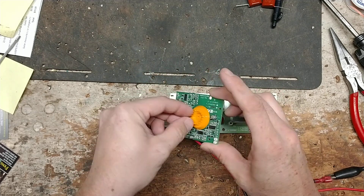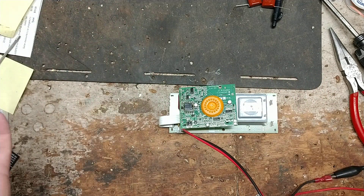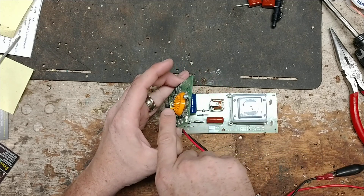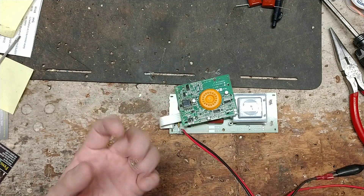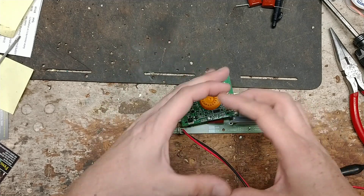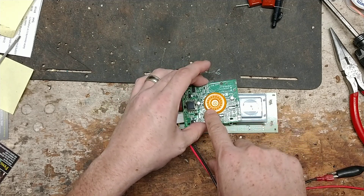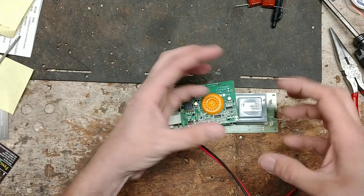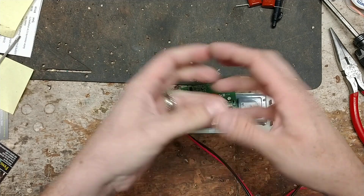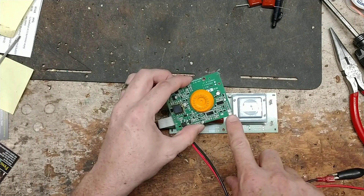This little piece here is part of the switch — this is where you turn it on and off. On the inside of the S50, this piece has little knobby teeth, including a longer one right here. The inside of the switch on the S50 and S20 itself has another piece with a similar shape but different — it has two little knobs and a notch where this long tooth sticks in. As you turn the outside switch, it rotates this inside switch piece, which turns the board.